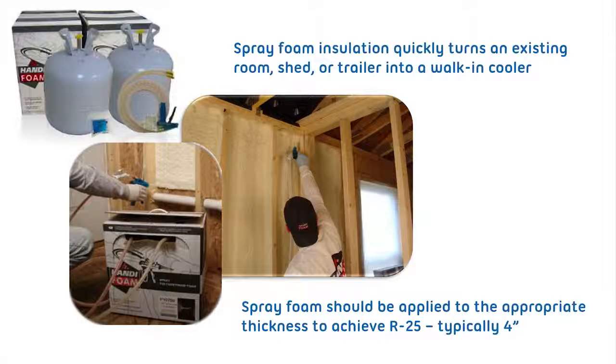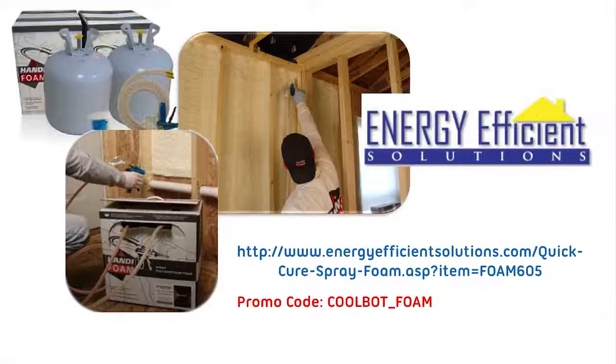Spray foam insulation quickly turns an existing room, shed, or trailer into a walk-in cooler. Spray foam should be applied to the appropriate thickness to achieve R25, typically 4 inches. Many of our customers have had great success with closed-cell polyurethane kits from energy-efficient solutions.